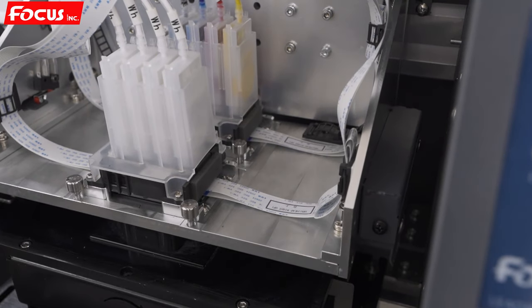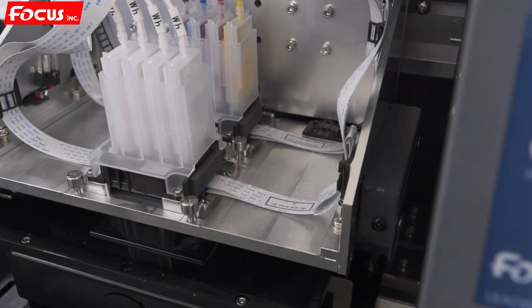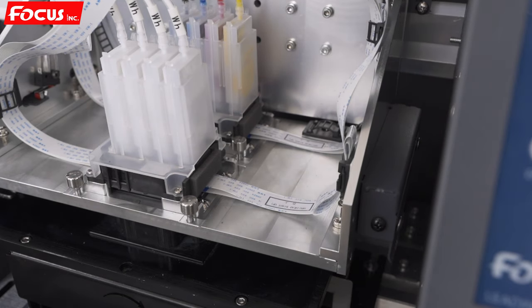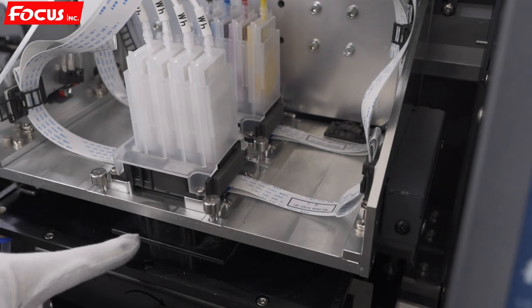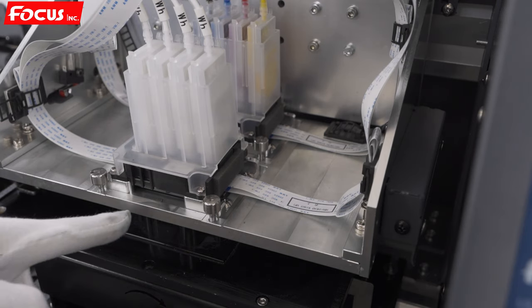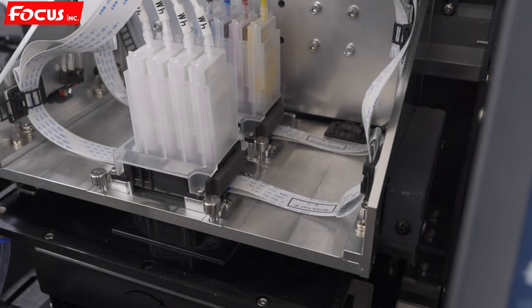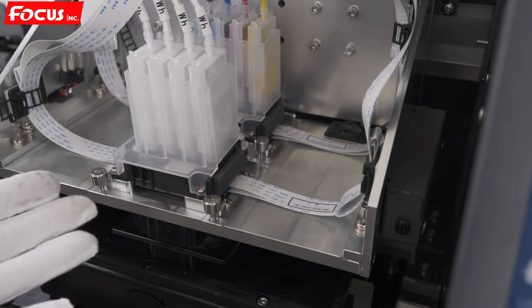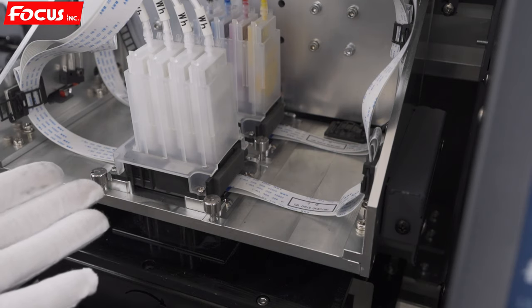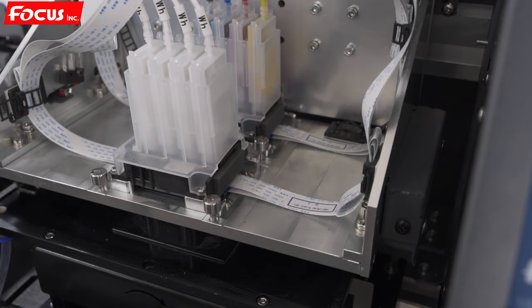Every day before you start printing, you need to do the cleaning process before you print again. Also, if the machine is not working for two or three days, you need to do a small test print every day. Pay attention to the clean solution on the cap station surface to make sure it will not dry out. If it is dry, you need to refill again. We must be sure both print heads are kept wet with the cap station using the clean solution, so the ink will not dry and the print head surface stays wet. This way the print head will not clog and you can start printing quickly next time.